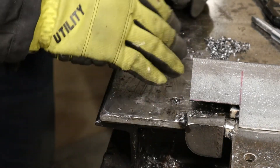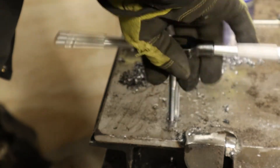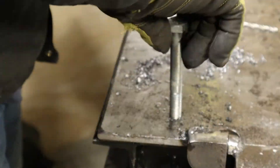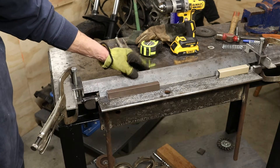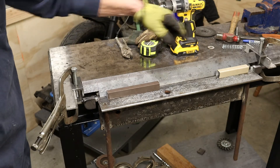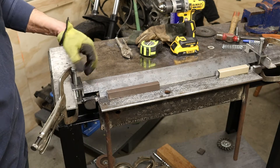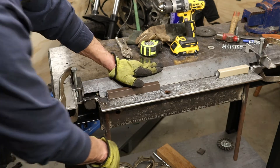It's looking pretty good. I now have my breaker bar set up. I've got a couple little pieces of trim that I've been using on the outside of the building to set my zero setback so this can't come forward anymore. Now I'll tack my two ends on to keep my angles. We'll put our springs under here once we take all this junk out and build ourselves a handle that screws into the table — that's how we'll tighten down our breaker bar to push down on the sheet and then we'll be able to fold it up.